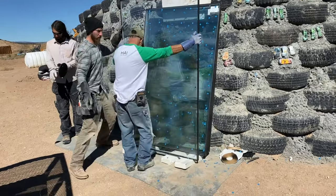And the other issue is, if it doesn't seat or sit flat, then when I go to put my mullion cap on, which in this case I added an extra strut for something more to attach to, then if I have just these two boards, which is what it called for in the plan, I end up putting my screw in the seam. So now I've got good meat. And I'm going to do extras also, the way I push the mullion cap back on, to really airtight and watertight this seam. It's extremely important that these details are paid attention to.